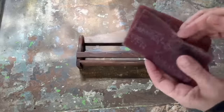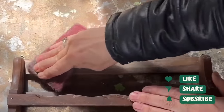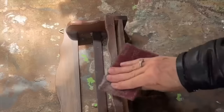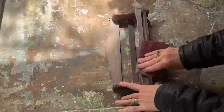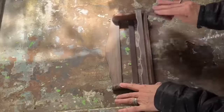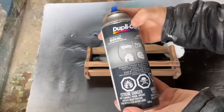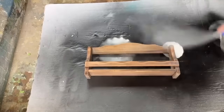Although the original finish on the spice rack was outdated, a quick fix with a scuff pad — linked in the description below — to lightly sand the surface works perfectly. This not only revealed a more modern looking color of wood, it also looks nicer than that dated orange stain. After wiping it down I sealed it up with my engine enamel, which is really durable and will allow you to wipe it down or dust it after it's finished.